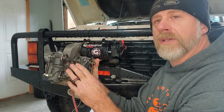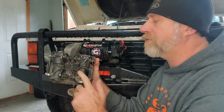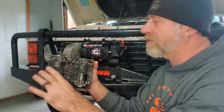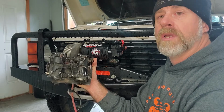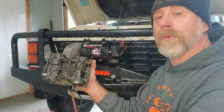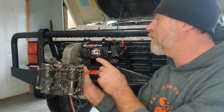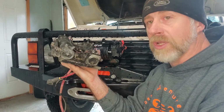There are YouTube videos. Other people have done some nice videos on how to test the individual solenoids. Usually, if you have one bad solenoid, you've got two. And at today's prices, are you going to just replace two and leave the two old ones? I don't know. I would replace all four. And if you're buying quality Warn replacements, you're going to end up paying more for these four than you are for a good Albright style solenoid. So like I said, obsolete.